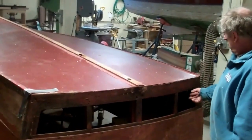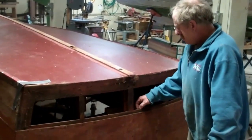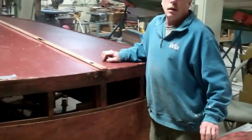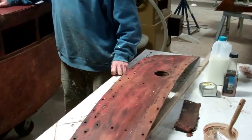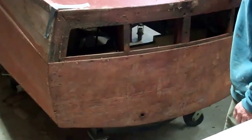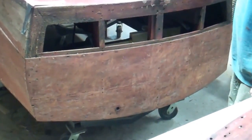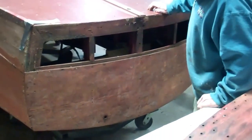What we discovered up in the nose were a bunch of weightlifting discs, and then these spring-loaded trim tabs in the back in an attempt to drop the nose and plane better. In the process, they reefed so much on this bottom plank that it's really distorted. If we fix that one and the fasteners are failing in the next two, it won't be long before movement causes the varnish we put on to fail as well.